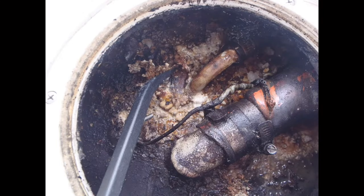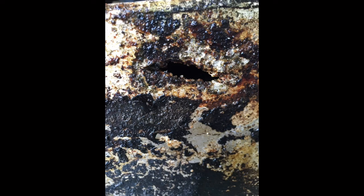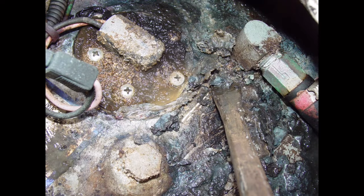While all fuel tanks should be inspected regularly for signs of leaks or corrosion, this is particularly true for aluminum fuel tanks installed below cockpit decks of open-style vessels, center consoles, walk-around cuddy cabins, and so forth. Such installations are especially prone to corrosion when water drips onto the top of the tank, often due to leaking cockpit deck inspection ports. A lot of times these ports will have little O-rings in them, and those O-rings will get dirty or broken, and they'll be missing when I do a survey, or they'll just be nasty and they leak. In the photos you're seeing here, water has combined with deck washdown dirt and debris to form a gooey slurry that creates a perfect storm of corrosion potential.